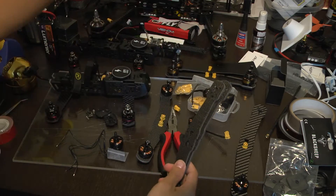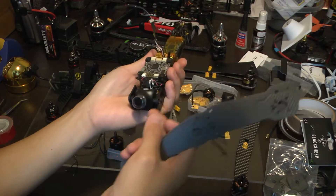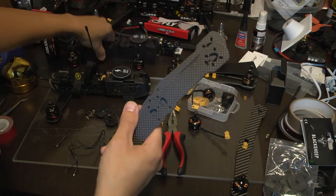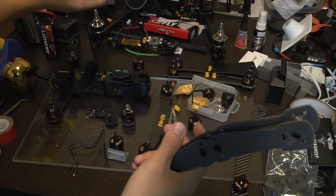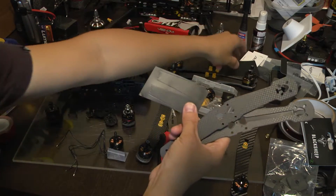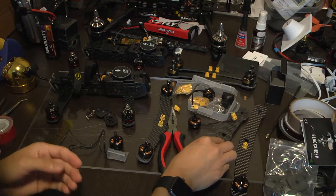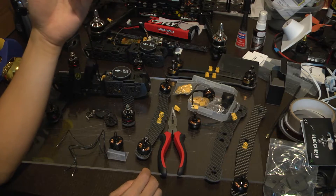What's interesting is that the new Vendetta with the packaging and everything actually includes two sets of arms. This is the new Vendetta — they've updated the Zero Zero camera, changed some things around. The power cube has the boot button on the bottom right here to change the firmware instead of up there. They changed the LED cover so it doesn't come off as easily. I'm working on this for a different build, a really long range FPV build. The most important thing is they include two extra arms and the nice sticky material to cover the wires. It's just more practical to replace the motor yourself rather than buy a new motor assembly.